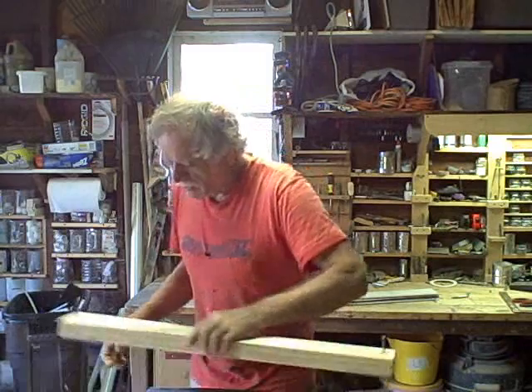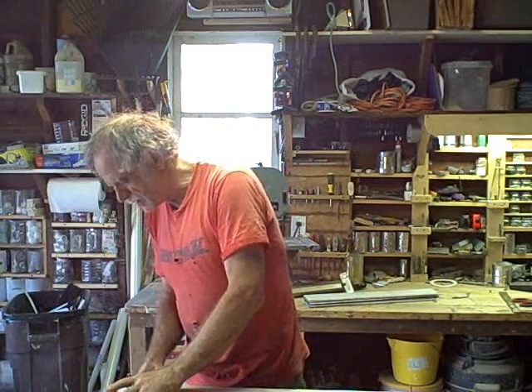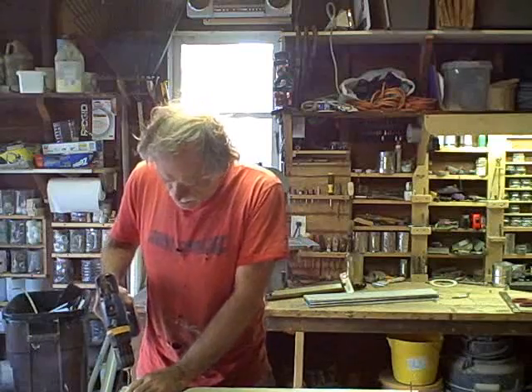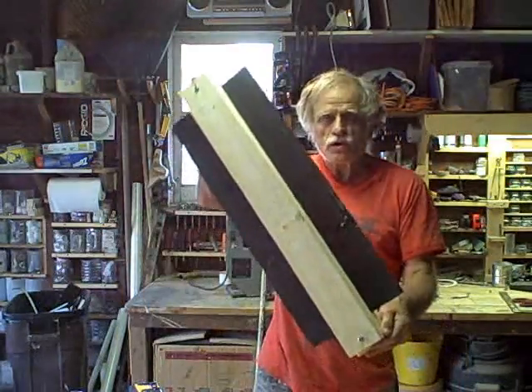In order to bend this, you use a little bending jig — a simple thing made with two 2x4s. Just put a screw in one side like this and line up your 2x4s. This will hold the sheet metal in place while you bend it. Now we've secured our sheet metal in our 2x4. All we have to do is bend it — it's just a simple matter, just like this. Bend the bottom tip and then bend the other tip. Bend it as much as we possibly can, then put another 2x4 on it.